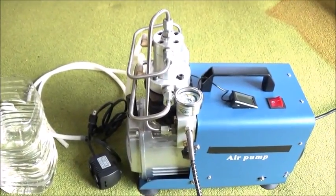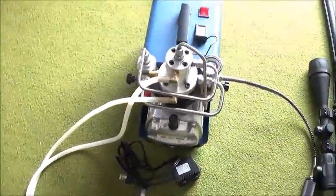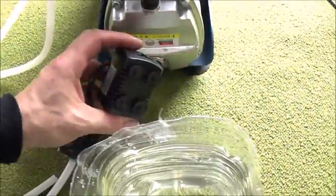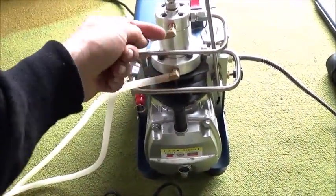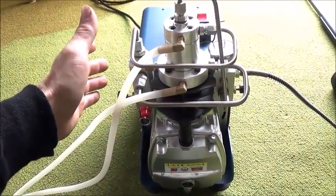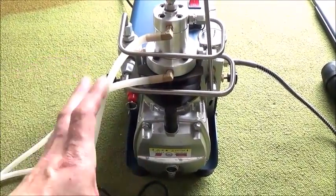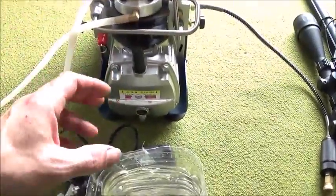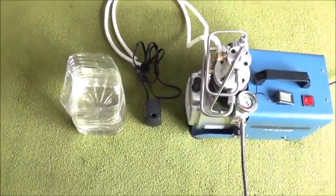That way you don't overheat these. It's really crucial to keep the temperature down on these two-stage cheaper air compressors. You're also going to get two pieces of hose tubing that go down to a cheap little fish tank water pump. You plug that in and it cycles cool water through the second stage of the compressor, keeping it cold — otherwise the thing would seize up. These get really, really hot fast. Run them for a small period of time. If you feel the water in your container getting too warm, turn it off and switch to cool water. If you take good care of them, change the oil, and keep them cool, these things will last a long time.